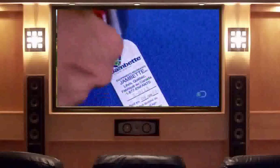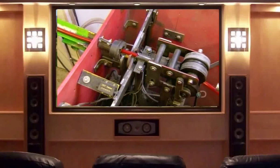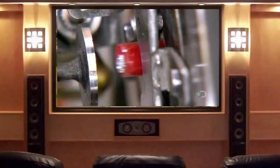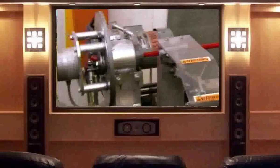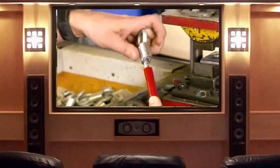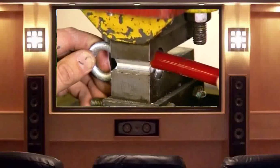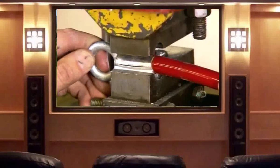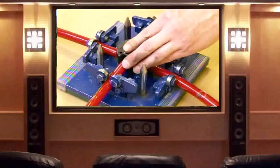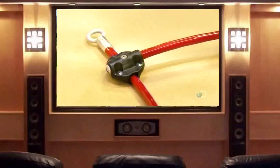They finish off the dinosaur with a metal label bearing product information. This factory also produces a climbing net made of galvanized steel cable — the hard cable is padded in polyurethane. Workers use hydraulic scissors to cut the required lengths of cable, then a cable stripper to slice off about 3 centimeters of polyurethane from the ends of certain cables. Workers cap each exposed end with a sleeved aluminum ring, crimping the sleeve with a 40-ton press. The rings will be bolted to the play structure's frame and anchoring system. Finally, workers assemble the cables into a grid, locking each intersection with a plastic connector whose central screw and corner rivets are made of stainless steel to resist rust.